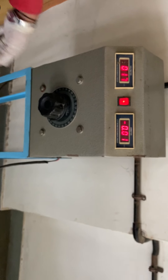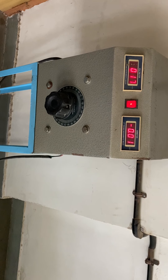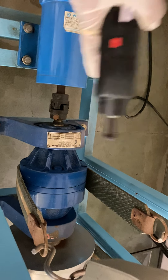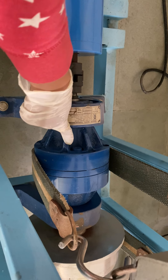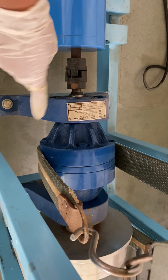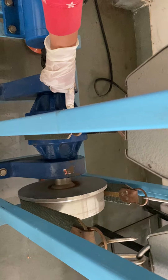First we are going to provide the speed for the input motor, so that the speed is transferred to the epicyclic gear train and after that to the output drum. Inside this drum — it is not visible from outside — there is an arrangement of the gear train, that is a sun and planet gear arrangement. The sun gear is connected to the motor shaft. The sun gear is meshed with the planet gears, and there are three planet gears inside this drum. These three planet gears are connected with the help of an arm, and the arm rotation is given to the output drum.